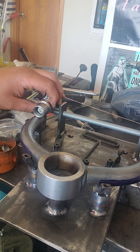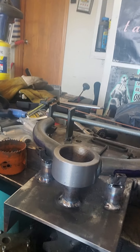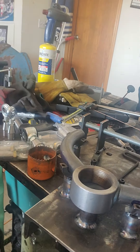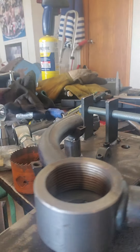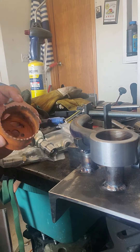Then what I did is I laid the stock upper in here so I could make a copy of it. I got these little nifty shaft clamps off of Amazon — I think they're like 15 bucks a piece. This tubing is one inch diameter, so these are a one inch ID. And then to get the location for the screw and ball joint — basically it's the same for left or right — I just took a washer and got the proper location, put it inside, clamped it together, put it in a little jig, measured the distance, and then just tack welded it.